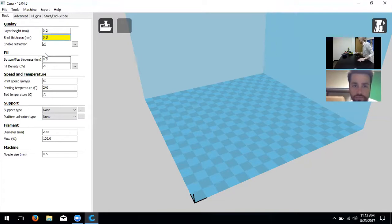Shell thickness determines wall thickness — for example, taking a box, the side edge will be at least 0.8 millimeters thick. That's two shells. At 0.4 that's one shell; at 1.2 that's three shells, making the exterior more durable. It's very compatible with the nozzle and easier for the printer to understand, giving you a thicker, more durable wall.